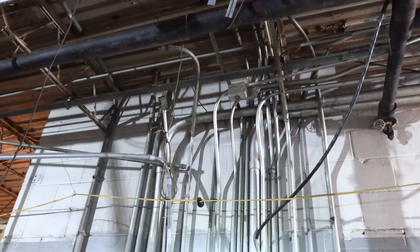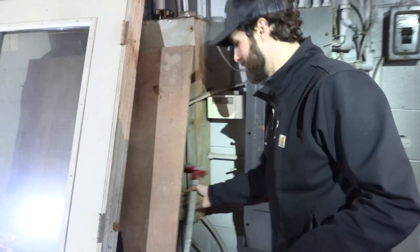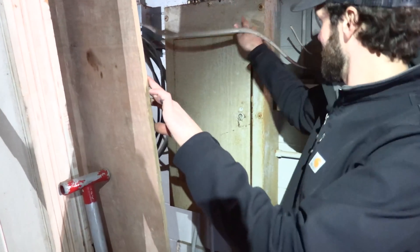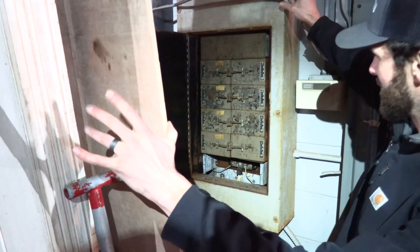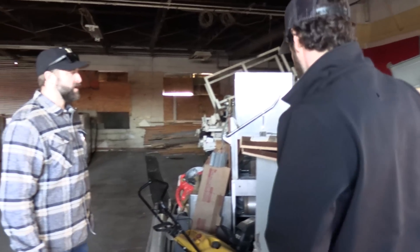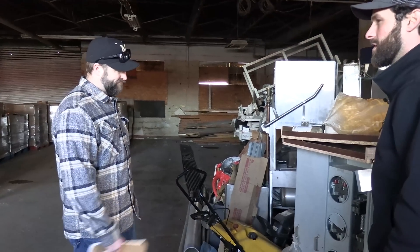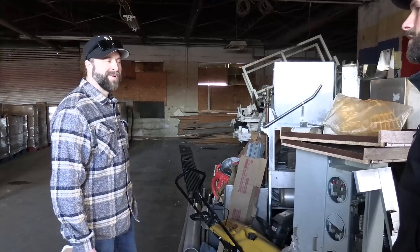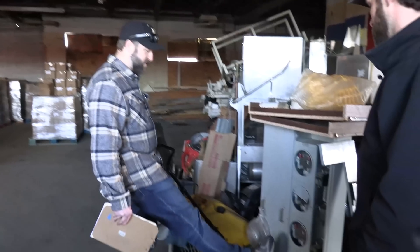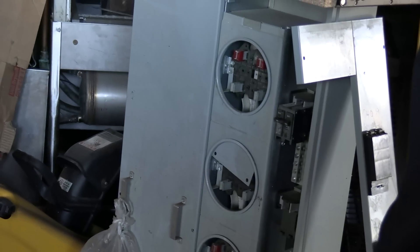Would you take a look at that — that was fine back in its day. And the Federal Pacific here on my right. But not to be outdone — violation of 110.26 — we have the Cleveland switchboard. I can't wait to dig around in this stuff. So five is your goal? Five is the goal — one warehouse, one house. Is this your retail warehouse, the 200? Probably warehouse. Honestly, it probably wouldn't matter. 125 — I think that's going to be plenty for retail, plenty for house. We're not planning on a big power draw, so it shouldn't really matter which one.